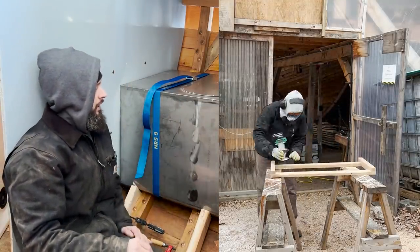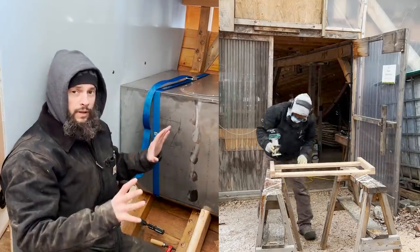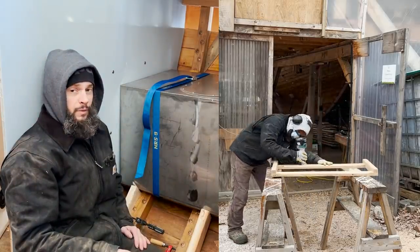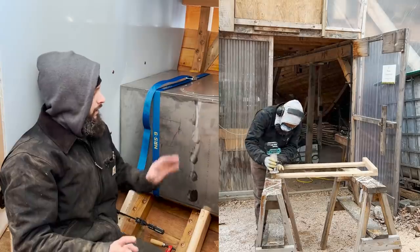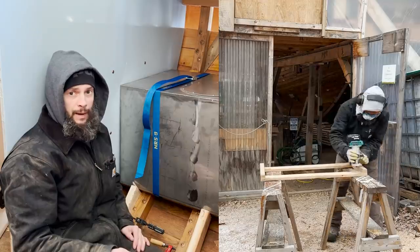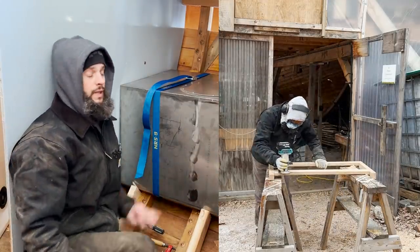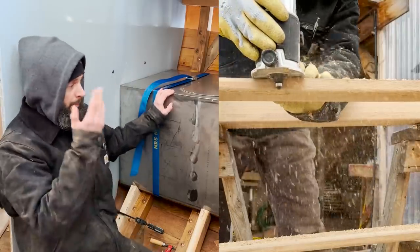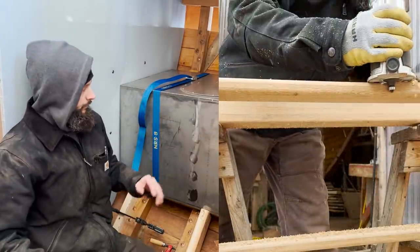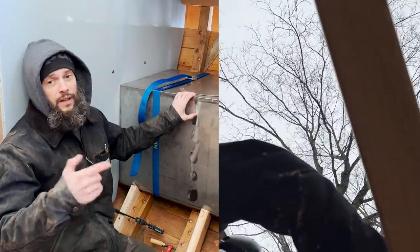These straps are gonna be there. They're gonna be permanent. And they are just to help kind of hold everything. And they are also basically in case of emergency. So if for some unearthly reason one of these oak partitions lets go, something happens, these straps will keep this tank from becoming totally adrift. They won't stop it from being able to move up and down and fore and aft a little bit, but they will stop it from going to the other side of the boat, which is ultimately what they're going to end up doing for this tank. The aft tank is a little bit different.